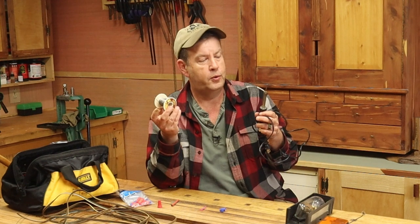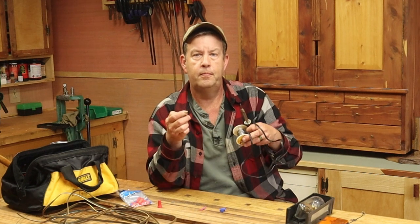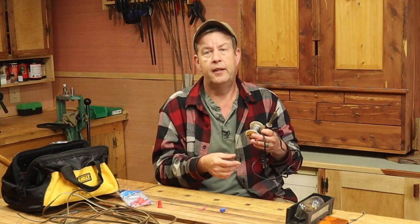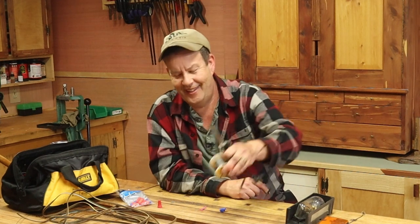it makes for a good connection, and it is strong, and it holds up very well. And then you take a piece of heat shrink tubing and bring that in over a soldered wire connection and then shrink that down. That's a good connection. That's what I wanted to do, but I didn't have time to fix this and actually finish the project. So we went with Scotch locks. They're going to work, though. They'll hold up.